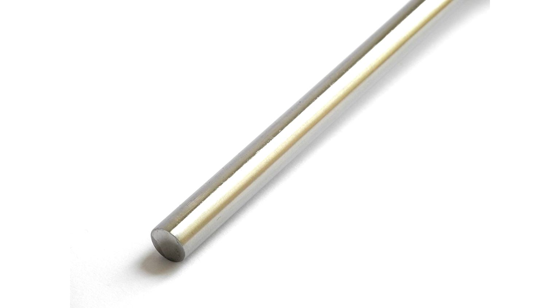Do you really need a burnisher? Possibly not. I've had reasonably good results in the past just by using either the back of a chisel or a nail punch. Some people say that you can use practically anything in the toolbox, like the shaft of a screwdriver for example. I disagree. I've not had good results using a screwdriver before. I think maybe the steel is too soft, or at least it's too soft with the screwdrivers that I own. The best thing about using a dedicated burnisher is that the shaft is made from hardened high carbon steel, so you know it's much harder than the steel in the card scraper, which is ideal for the purpose. I'd recommend trying some things that you have already, and if you don't have any luck, then it might be worth investing in a burnisher.